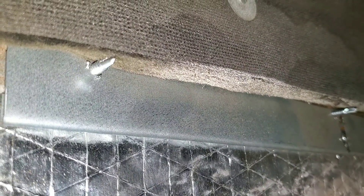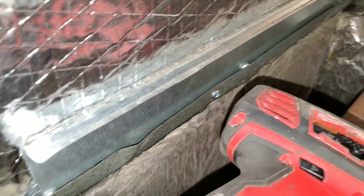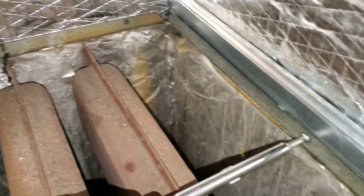Make sure that you catch the flaps that are on the inside of the new frame for your evaporative coil. Secure the bottom of the frame as well. Once you secure all three sides, apply duct seal. This will help minimize airflow loss.